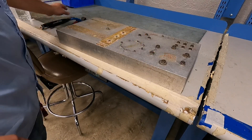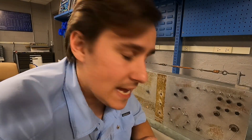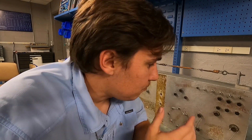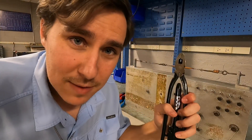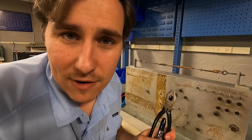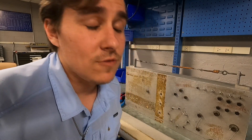So there's single wrap, and then there is using the cross method - both of these were done by hand. Didn't even need the safety wire pliers. I realized this one did not look pretty, but the point was not to look pretty. The point was to show you what's going to happen with your hand placement if your hands are too far apart or too close together. It just takes practice - I can show you a dozen times, but it takes you practicing as much as you can to really get good at it, until you learn about safety wire pliers. Once you use safety wire pliers, you'll never go back. Every aircraft mechanic in the world uses them because it's fast, clean, simple, and even - it solves all the problems of doing it by hand. But some schools will not let you use safety wire pliers until you've done it by hand a couple of times, because there are situations on the aircraft where there's no way to get the pliers in there. If you enjoyed the video, leave me a like, comment, subscribe, and as always, go build something.